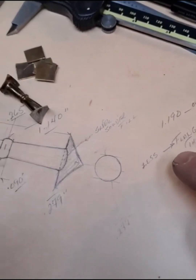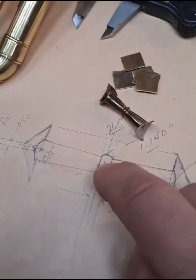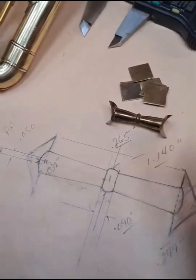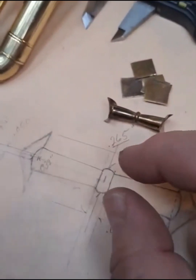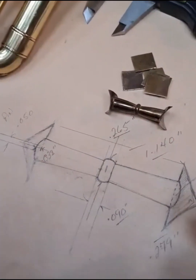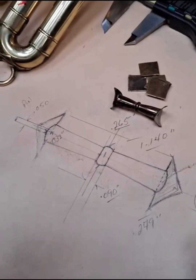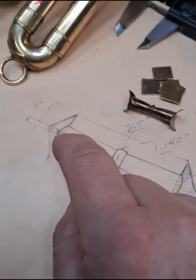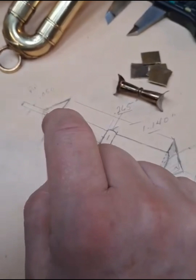Anyway, so now that tells us what our brace length is, and then we've also worked out the dimensions of the girdle and the ends of that spanner. And so we establish those, we machine those points, and then we just use a mill bastard and connect the dots. You don't have to start cutting tapers and silly stuff like that. This is a brace, for crying out loud. But I will machine a pin on the ends. Okay, the farthest end of the rod that's being machined.